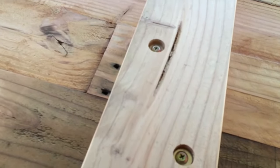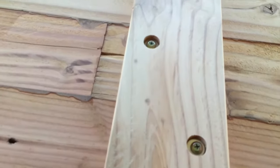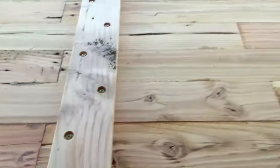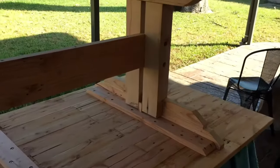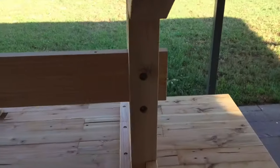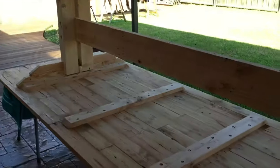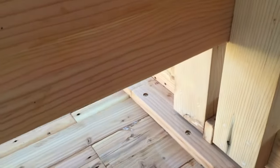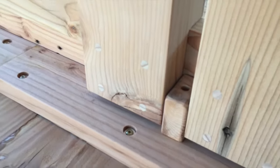The braces are not glued in place, and the clearance holes in the brace for those screws are oversized — larger than what I normally would do. The countersunk holes are flat because I used a forstner bit, and together with a flat washer and flat head screws, hopefully there can be a little bit of movement between the table and the cross brace. At the end of the table I've also added little tabs onto the cross brace that help keep the table centered across the width.